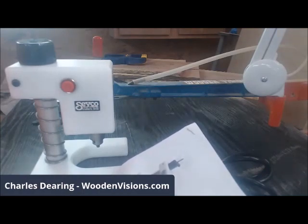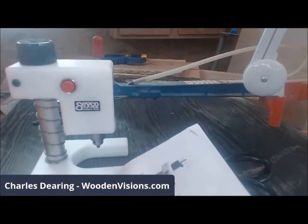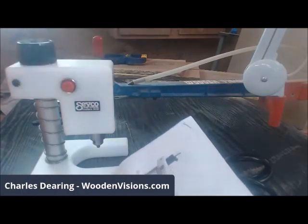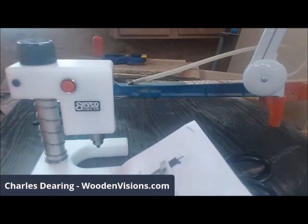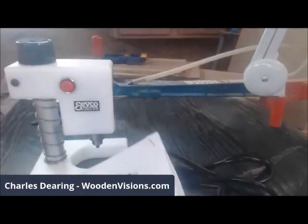Plug in the power supply. Grasp the plunging block — which is this base here — with either your thumb or pointer finger positioned on the push switch, which is right here. Set the drill's base on top of your workpiece over the first hole you want to drill. A piece of cardboard on your workpiece will provide space for the bit to come through yet not damage your bench top. Push the switch straight in with your thumb or pointer finger, push straight down on the plunger as you guide the bit to the intended hole.